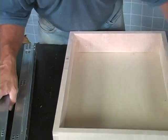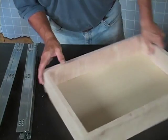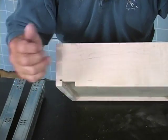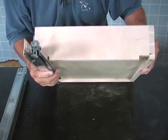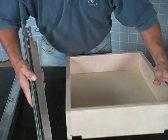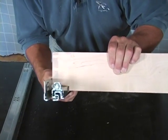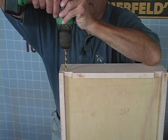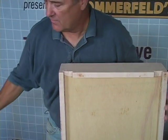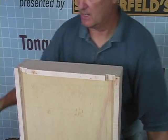You can do that a bunch of different ways. One way is this drawer here — you can see we just left the back of that drawer out. The other way is what I did here: I just took this over to the table saw and made a series of cuts and notched and relieved it there. You can also take a flush trim bit and flush trim it. Once you have that relieved, you can see where my drawer slide is going to fit in there. These drawer slides have a little tip on them — we have to mark where that's going to go. I set my slide onto here and hit it — you can see the little indentation it makes. All we have to do is drill a quarter-inch hole about halfway through that back. I just mark them like that and drill them freehand.